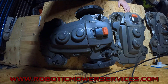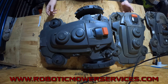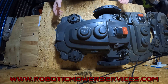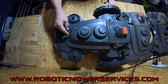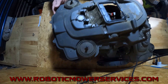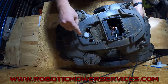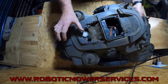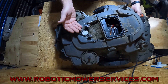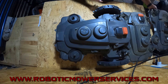What we're talking about is the chassis air filter on these mowers. If you're familiar with the regular 450s and 430s, you've probably seen our videos where the chassis air filter is up front. I've actually got one here — an upper chassis. You take the nose piece off up here and the hinge piece for your hatch, and there is your chassis air filter. That's what allows the cool air to get in there to cool the chassis, lets the hot air get out, and helps keep everything working the way it should.